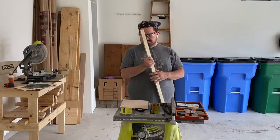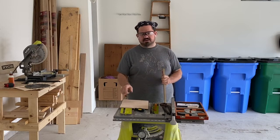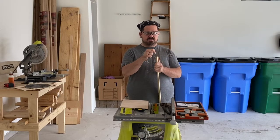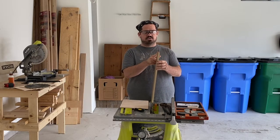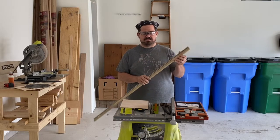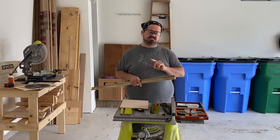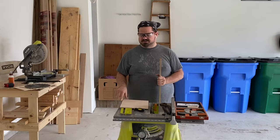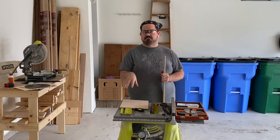And from here, what I will be doing is taking measurements off the sides and then cutting them in to the 1/4 inch inset, which means at a 1/4 inch is where I will be measuring. And I know that sounds confusing, but since these edges will be that far in, I need to make sure this edge fits perfectly on that, so that when I square it up and actually have the sides done, it squares perfectly and it holds without any kind of movement.